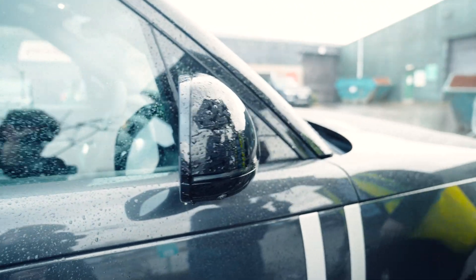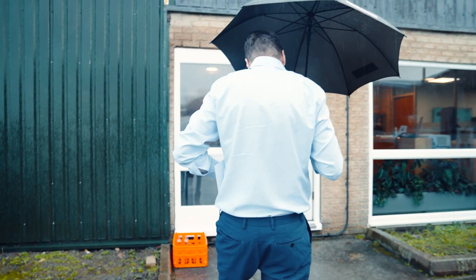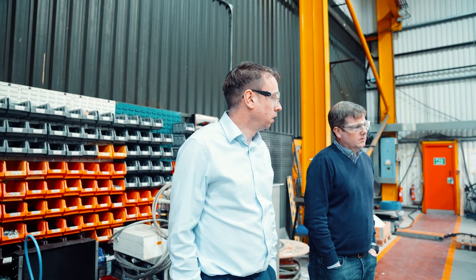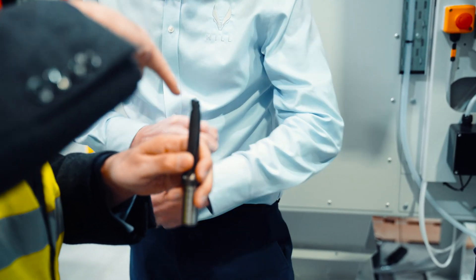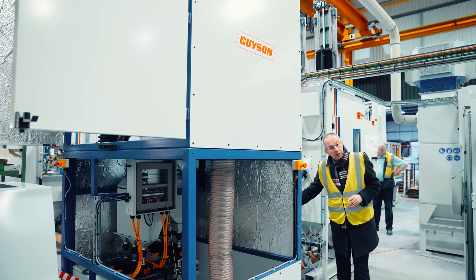Morning, Richard. Jase, pleased to meet you. Nice to meet you. Milan? Milan, that's the one. This shot peening machine falls into automatic and special systems technology through the application of a really nicely industrial-engineered setup. You'll see a radius — this shot peening machine is peening into those pockets to stop fatigue cracks. We do have an automatic refill system.